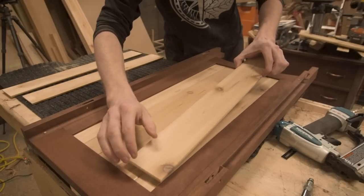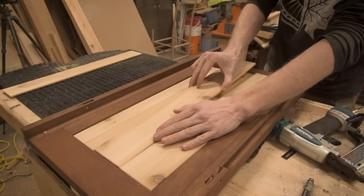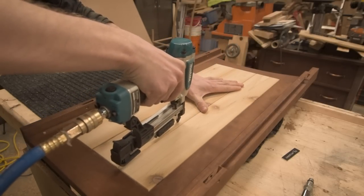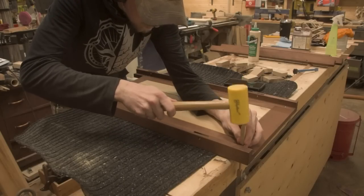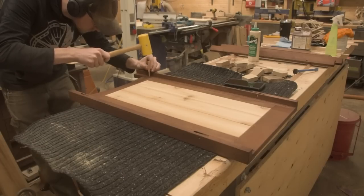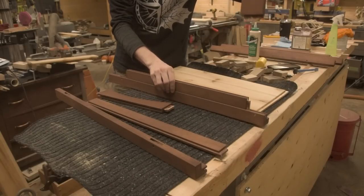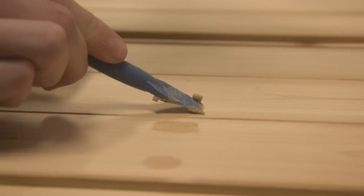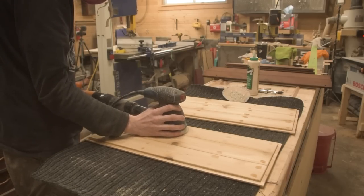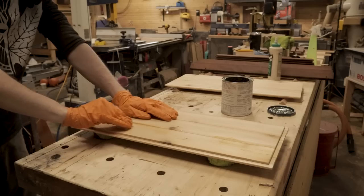The side panels here are kind of a weird construction — I have those slats going into the outside grooves and I'm now gluing in these inside pieces. This works surprisingly well. These panels are not insanely strong, but they don't need to be. As long as you make sure you don't get any glue squeeze out permanently gluing that panel to the frame, you're going to be just fine. What's interesting is it takes these individual slats and basically turns them into one solid panel without any tongue and groove joinery. You can just remove that solid panel compared to the individual slats before, then fill in the pin nail holes. Great for these floating panels.